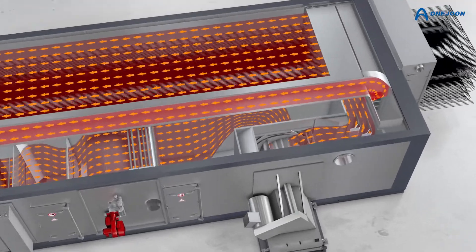The supply end seal provides primary and secondary supply air, which ensures best-in-class airflow and temperature uniformity over the entire process chamber, as well as separating the contaminated process air from the external environment. The structure consists of the supply air channel, a diverter plate, and the return air channel.